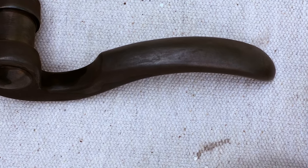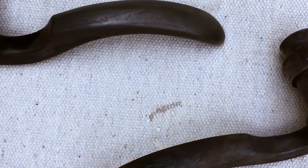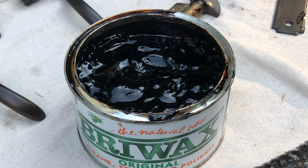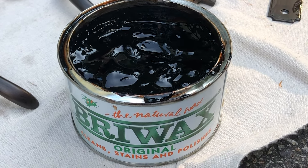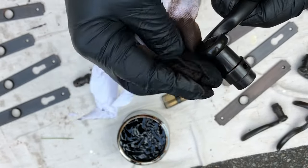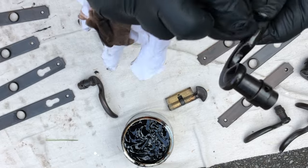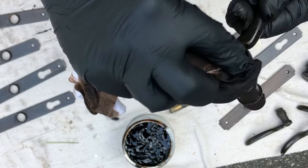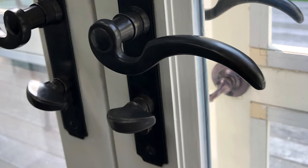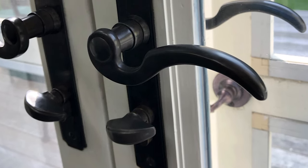Note that this is a living finish, which means it will wear off over time with use. You can leave the pieces just as they are, or for a little extra protection, you can wax them. Apply the wax liberally with a soft cloth. You can use clear wax or a wax with stain. We used a dark brown wax to shift the color of the final product to a warmer hue. Let the wax dry, and then lightly buff it with a cotton cloth.